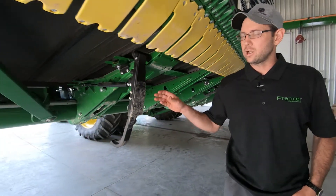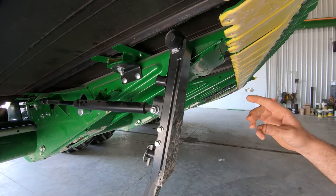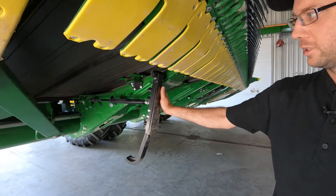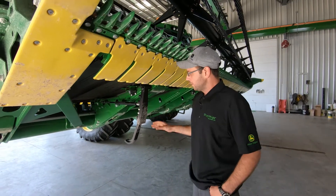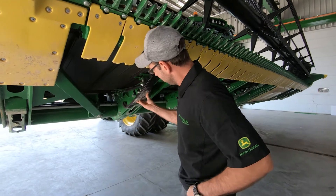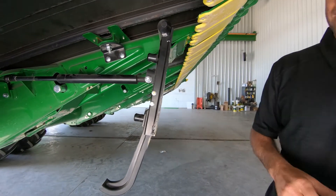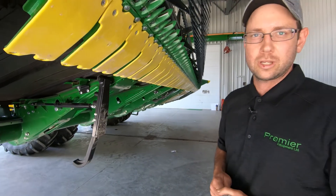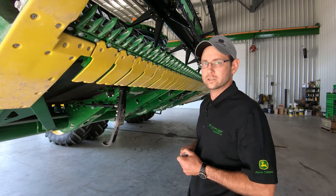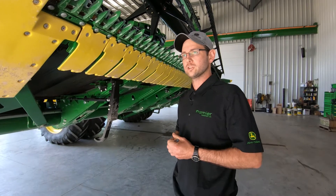For off-ground cutting conditions — for small grains, cereals, and such — we like to cut off the ground. This system is an option from John Deere and a lot of guys are going with it so they can run auto header height controls. To activate the auxiliary height sensors, you take the small clip out of the back of the header arm and lower the arm down. These auxiliary height sensors will need to be calibrated when switching to them — your hydroflex pressure will have to be up and the header locked out. For 600 Series heads, they have to be plugged in on the back of the header, so make sure you do that.